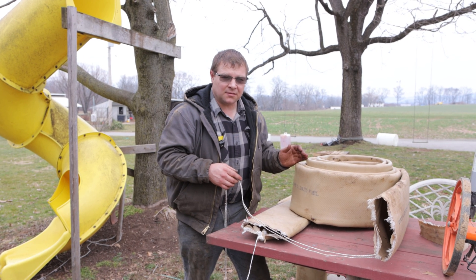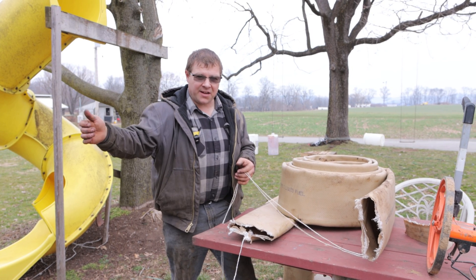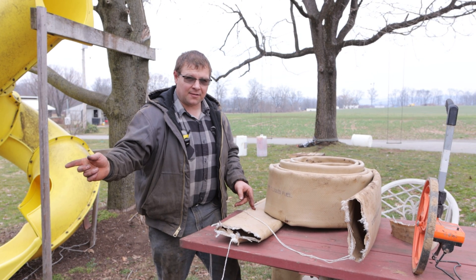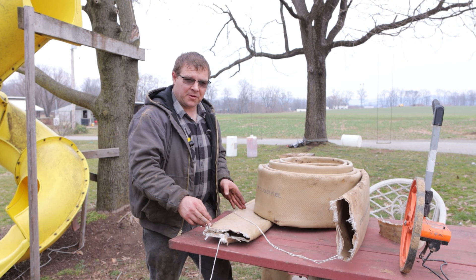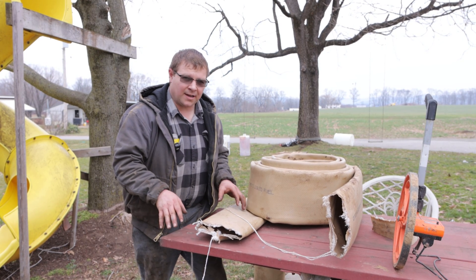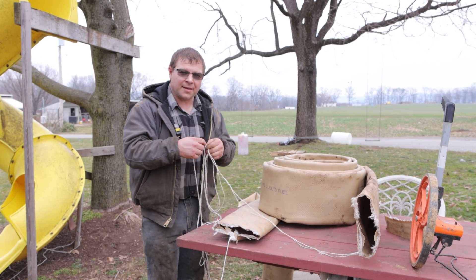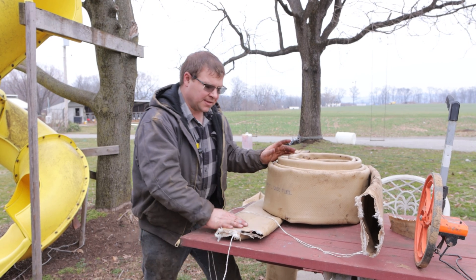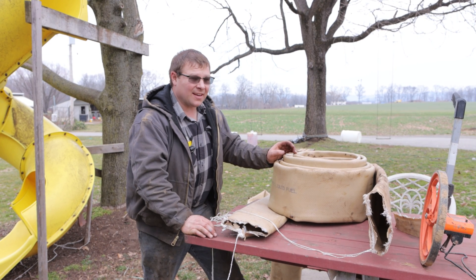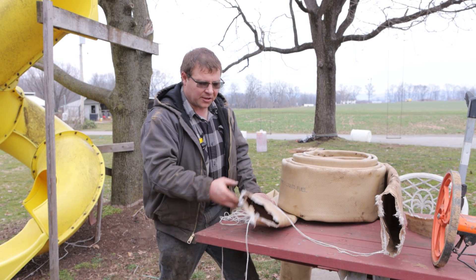Each time we pulled this same piece of hose it tore off at a lower pound rating. The first time was 28,000 pounds at the tractor end. We cut about two feet off, swapped ends, and the second time it tore at around 23,000 pounds. We also noticed cords — the cords that run lengthwise inside the hose — and after the first pull we had some 30 to 40-foot-long cords that pulled out of the 70-foot hose. The third time we pulled, it was 19,000 pounds when it tore in the middle of the hose.